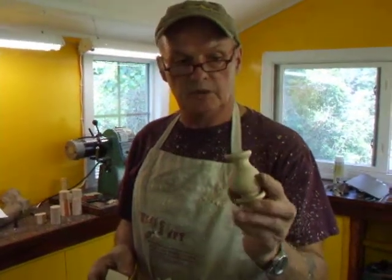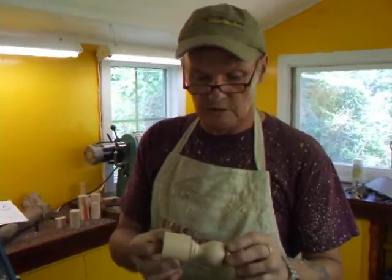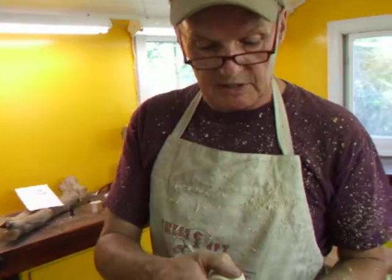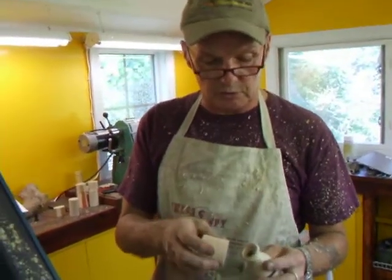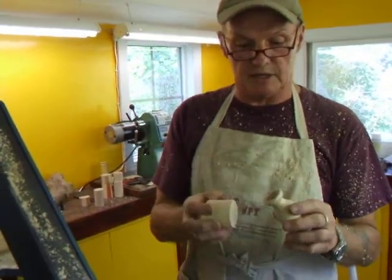Okay, here's the body of the scent bottle container, and we're going to use this piece of wood to make a lid. Now, fitting the lid into here, it could be screwed, but we're just going to do a push in. If we turn this between centres, we'd have to keep taking it off the lid to try it in.